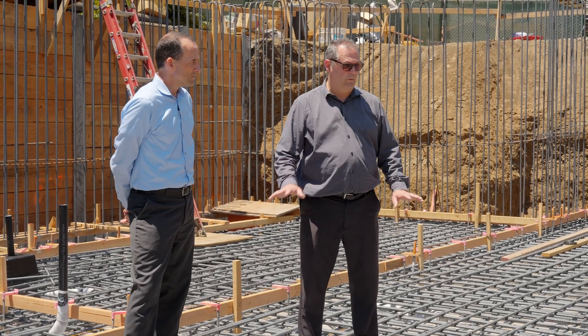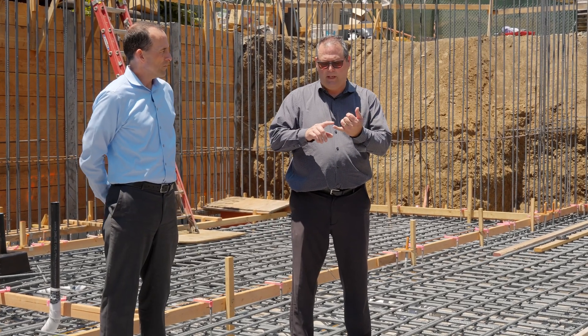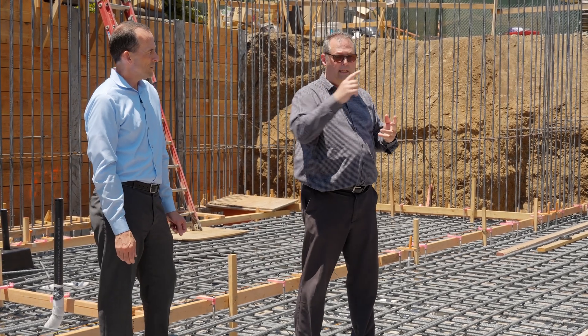So there's a lot of things going on with this floor. You have the mat slab. On top of that mat slab we have to think about insulation, so we've got an inch and a half of EPS going on top of the slab. On top of that we have an inch and a half of gypcrete, so we can run our radiant heating through it — because we have radiant heating in this floor.